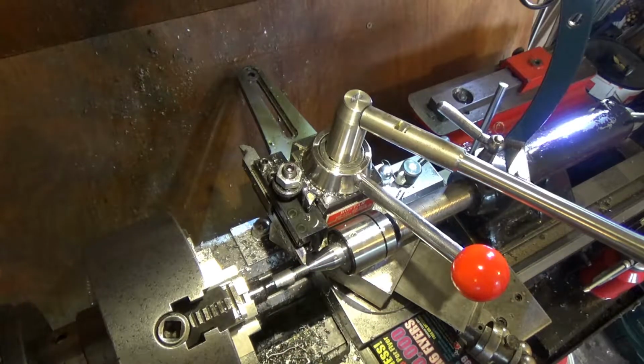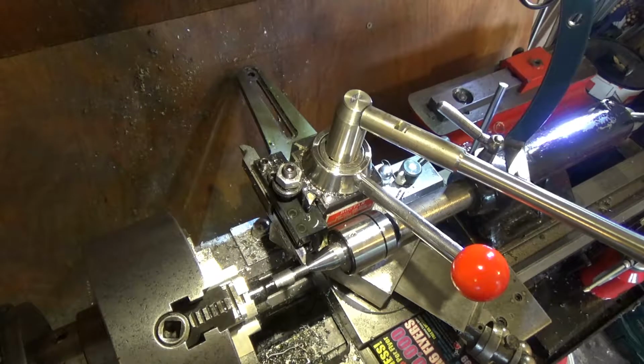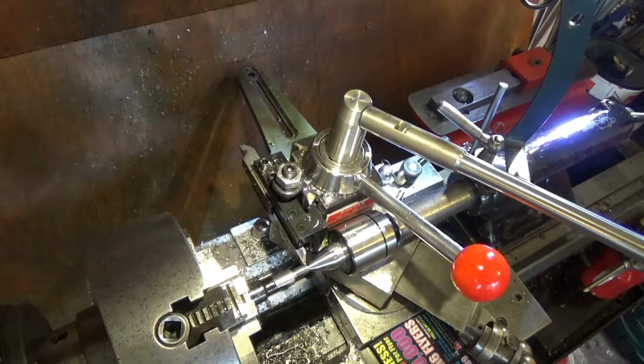Okay, well I went past my 27 thou to 38 thou because 27 thou didn't look right, and then I've just done loads and loads of skim passes until it's still cutting at 38 thou, so there must have been a lot of tool pressure on that, and now I've overcut it. I can tell straight away that it will fit straight in because I've overcut it. Well, let's try the wire gauges anyway, just for a laugh.